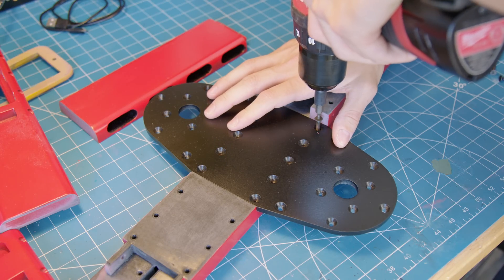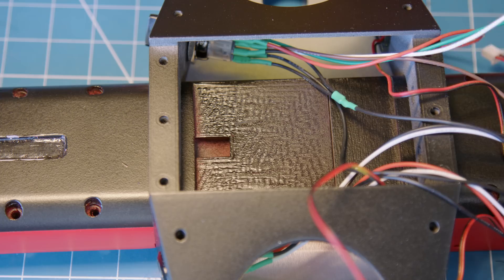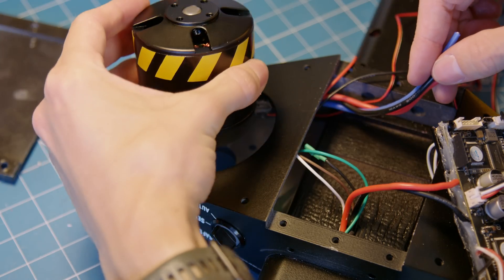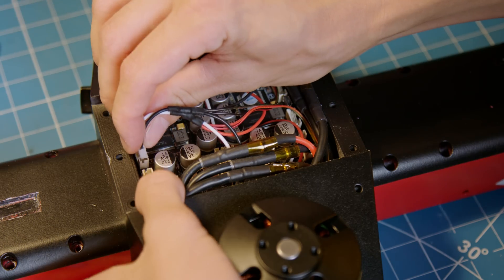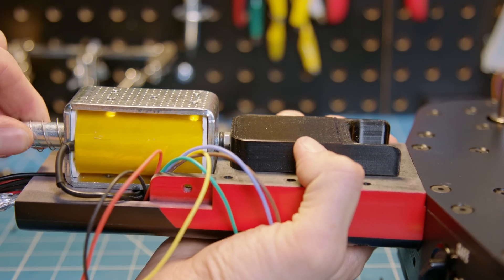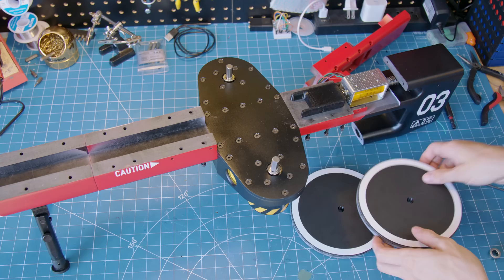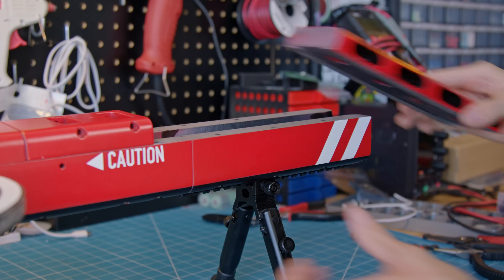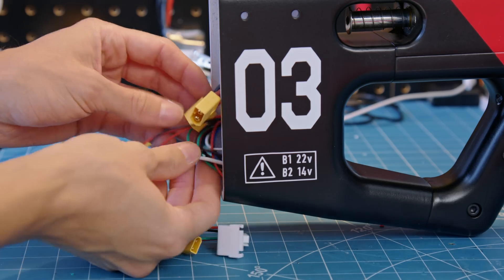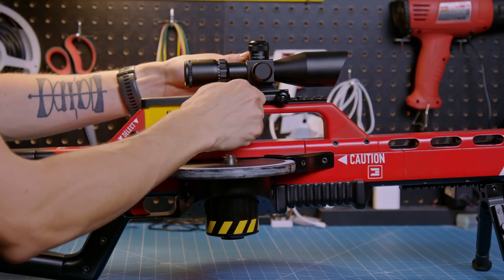After throwing a coat of paint on it, the plate was ready to mount on top of the 15mm rods, completing the main framework of the cannon. Next up was mounting all the electronics, and to keep everything looking clean, I designed some hidden channels throughout the frame so I could run all the wires out the back. While mounting the ESC board and motors, I realized I completely underestimated how much clearance was needed below the motor mount — once everything was connected, it was an extremely tight fit with only a few millimeters of clearance in some places. Next was mounting the solenoid before screwing on the push arm that fires the condiments out of the magazine and into the spinning wheels. With all the wires run, I attached the rear stock and gave the firing mechanism a test, then put the discs onto the motors and screwed the trigger assembly into place. By now I was in the home stretch — all that was left was the barrel and a few accessories. To mount the electronics, I opted to cram them into the rear stock. The scope I picked is objectively overkill, but I think it fits the look, so we're keeping it. And at this point, it looks like we have a completed condiment cannon.